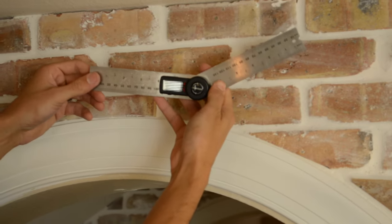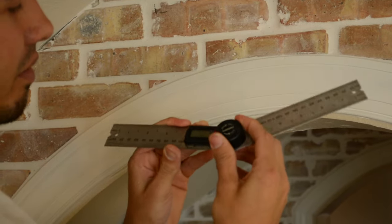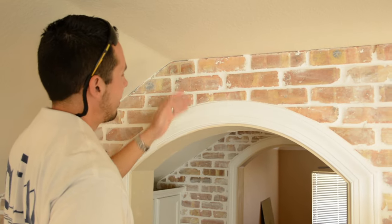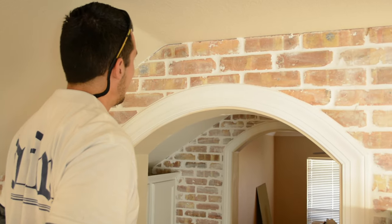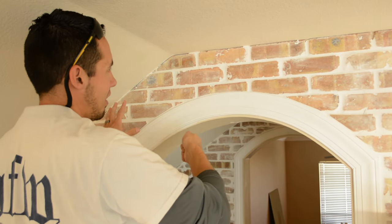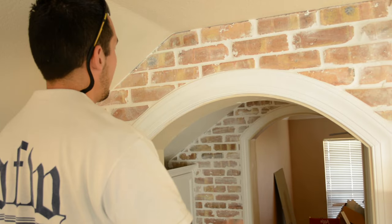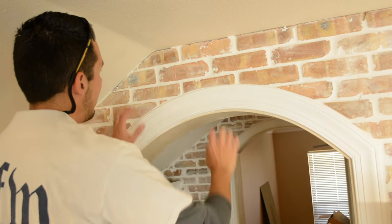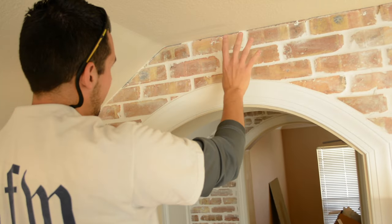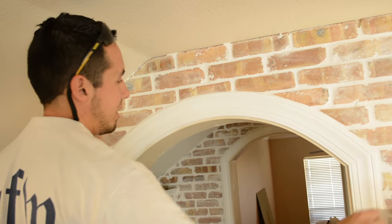You can see mine is 30.5. That 0.5 really isn't going to make a difference — I'm just going to call this 30 degrees and split that in half, and that'll give me 15. Because when you're on the miter saw outside trying to dial in a 0.5 and split a 0.5 in half, it's not even worth it. You'll still get the same clean cut just making each side 15. So I know it's 15 degrees on each side to equal that 30.